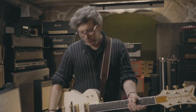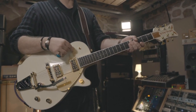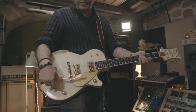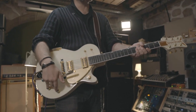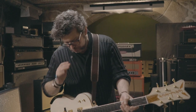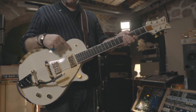This is a tone control. So instead of having a tone control like this in a pot, you have three options of tone. That's it. No intermediate. So this is bridge volume, neck volume. This is master volume. Why the difference? These two don't have treble bleed. This has a treble bleed. I'll go there in a minute. So, well, I'll go there immediately. This is the tone. In the middle, it's off.